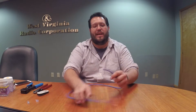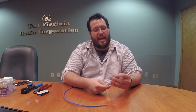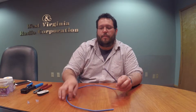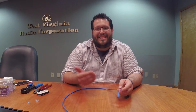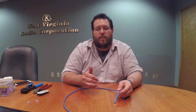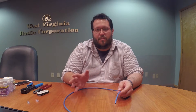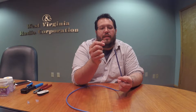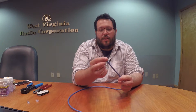I have here a piece of everyday standard Cat6 — this is non-plenum. The rules are, if you're running Cat6 through your building anywhere in a ventilation area, such as through air ducts, you have to use plenum cable. It might vary from state to state, but if you're running Ethernet in an air duct you have to use plenum. Non-plenum cable's plastic jacket is actually toxic when it burns, so you have to run plenum so that in the event of a fire you don't spread toxic fumes through the building.